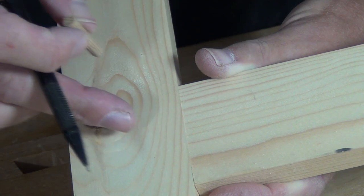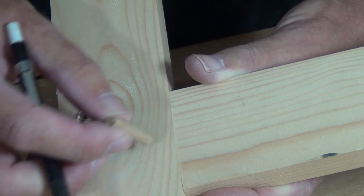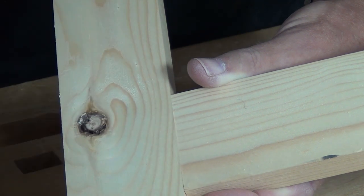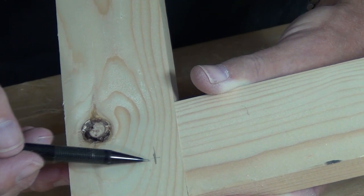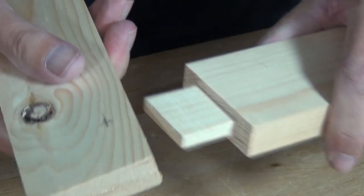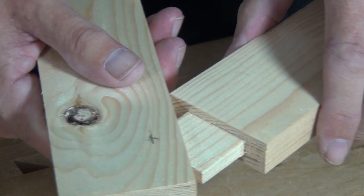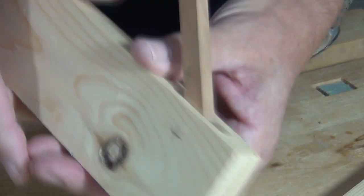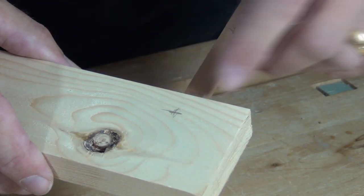We'll need to put our peg in — we don't want to be too close to the edge of this section in case we split it; we want to maintain quite a bit of strength there. So we'll come back perhaps two to two-and-a-half times the diameter of the peg itself. We'll centre it roughly there and centralise it on the tenon. When we bore this hole we want to make sure we take the tenon out, or at least release it most of the way. You can use the corner of a tenon to back up that hole so that when you're boring it you don't break too much material off on the inside of the mortise. An alternative is to get a packing piece the right size to fit in there — drill the first hole, take the packing piece out and then continue the hole through the other side. You can do blind draw bores if you've got enough material on the back side.